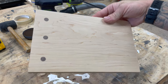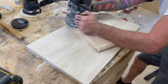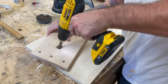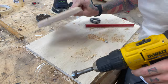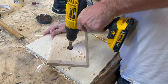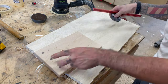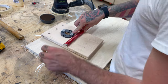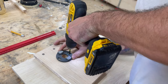After I flush-trimmed those dowels down I did a little bit of sanding. Then I noticed it needed something else — a chamfer on the back. I knew my wall wasn't perfectly flat, so the chamfer makes it look like it's floating and hides the fact that it's not flush. Also, when drilling holes, drill halfway through from one side and then finish from the other side — it keeps you from blowing out the back, even though you'll never see it.